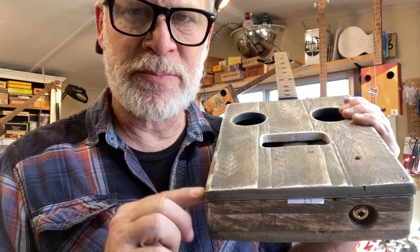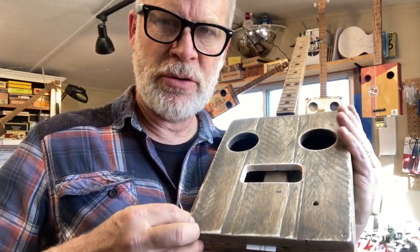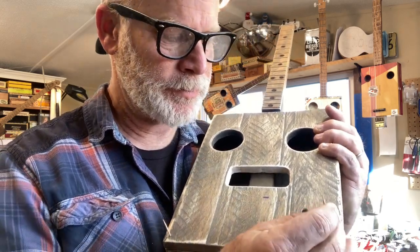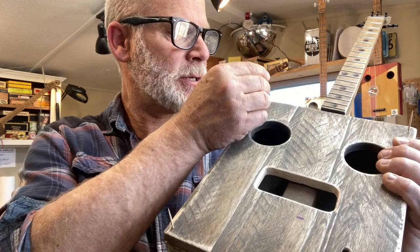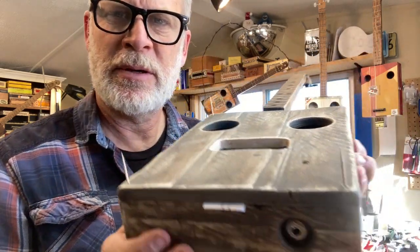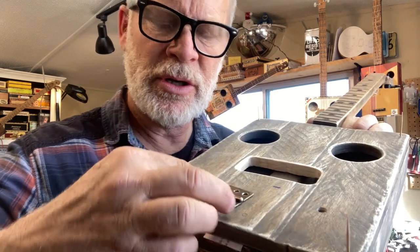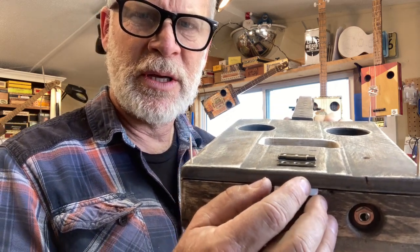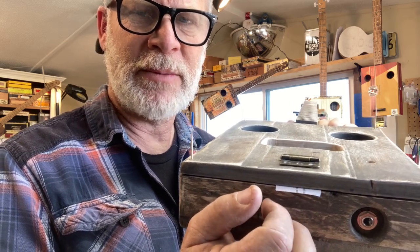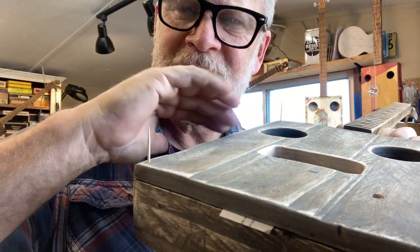Well, in order to ensure that the top is properly lined, especially when doing things like doing pickup cuts and whatnot, I just get a toothpick and jam it in the hole on all four corners. And this gives me confidence that my top is lined up to the bottom. And the reason why I was doing that is because you can see these little pencil marks here that I've got for the screw holes for the hinge. Well, I wanted to make sure that they were in a direct alignment with the piece of wood. And I wanted to remove all guesswork. Sometimes I'll put marks over here, but I figured the flap would work this time here. I just want to make sure not to impale yourself, because that would hurt.